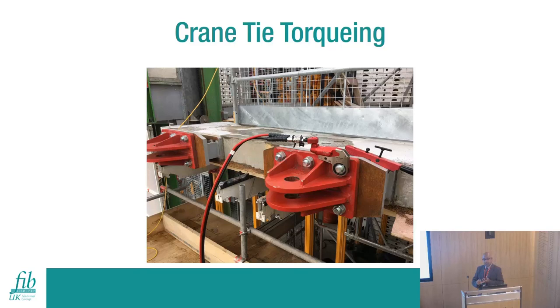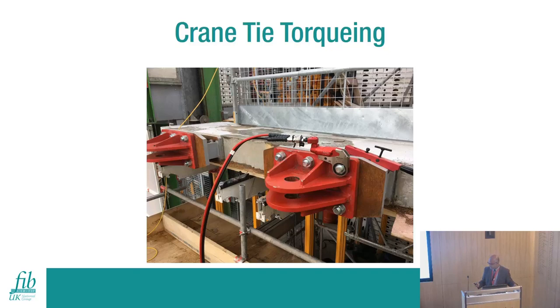In summary, for high-rise building constructability, you need to consider: cladding connections and additional services, crane ties, plumbing holes and additional penetrations. Temporary plumbing holes must be planned - a concrete boom will pass through the slab, so cater for that load when designing even a 200mm thick slab. Account for gullies and other elements, and consider deflections throughout. That concludes my presentation - I hope you found it useful and I welcome any questions.